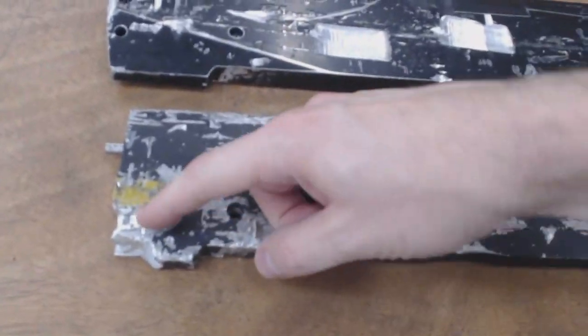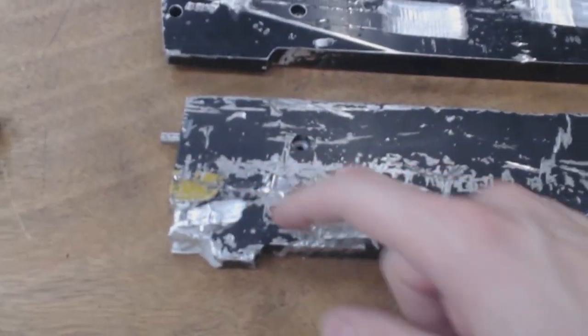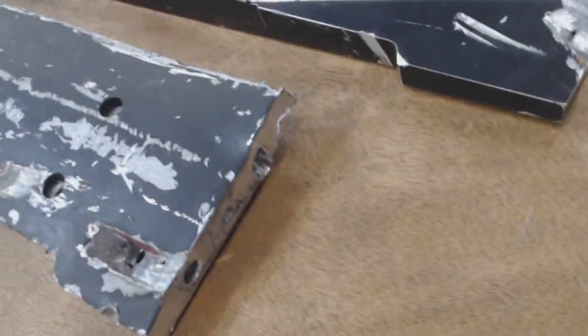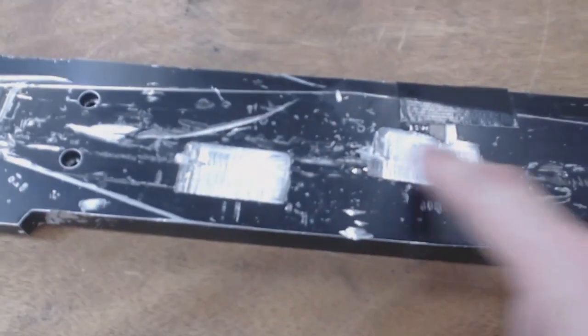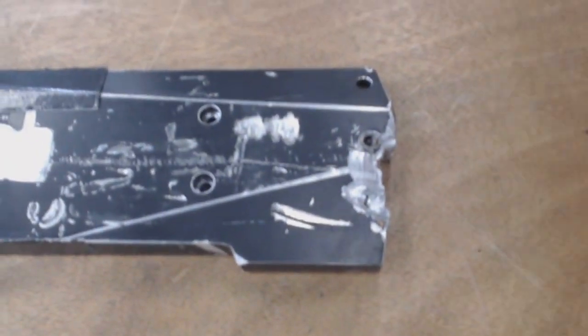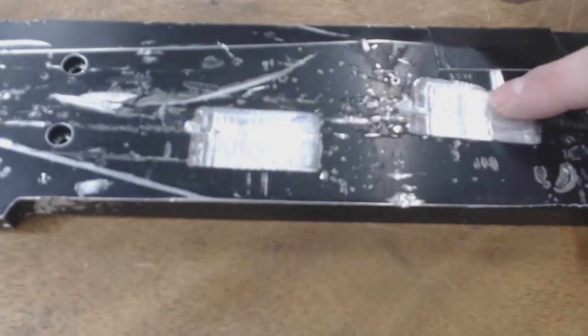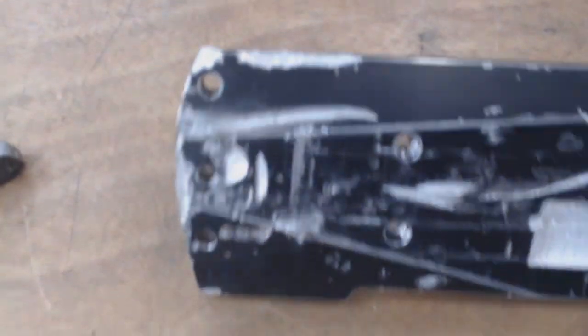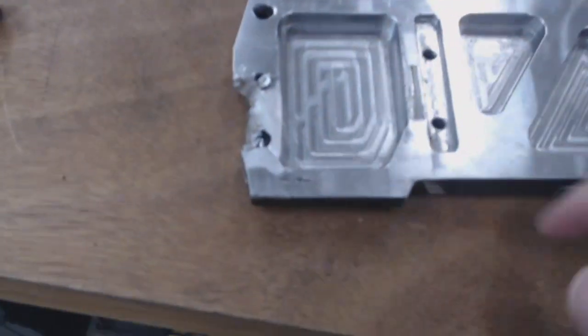So if we look at the 60-61, you can see these large gouges and cuts, and it just looks like the material was cut out of it. And then we have these nice bends in it. So the material gave way a lot better, it seems. But if we look at the 70-75, other than this and this, the material tended to crack off. So it's a lot harder, and that's exactly what you'd think from 70-75. I'm sure these two cuts right here took a lot of energy because it was just carved in. But generally speaking, if the material was going to give way, it just broke.